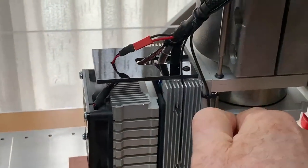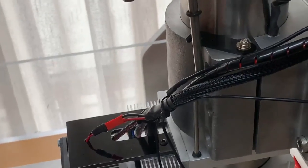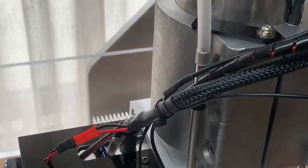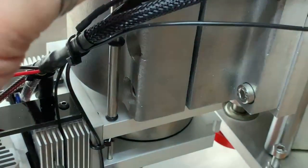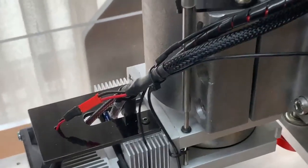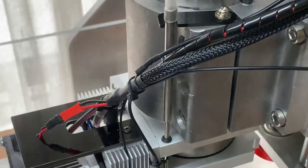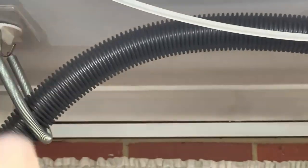The air assist pipe comes up to a tube which sits in here. This tube can just pull off so I can remove the head when I want. For air assist I just drop it on. I found that when I fire up the compressor it used to pop off due to the initial surge, so I have this little ring which I put around so it can't come up. There's a little bit of air leakage but it doesn't really matter — it makes it very easy to take on and off. The air hose runs all the way over the top of the roof.